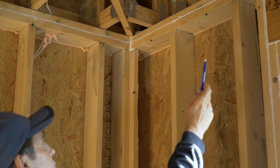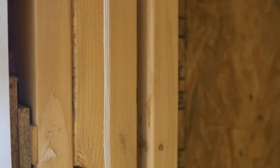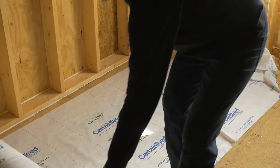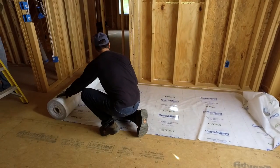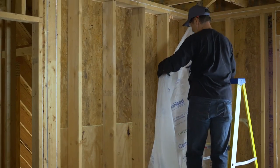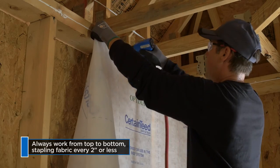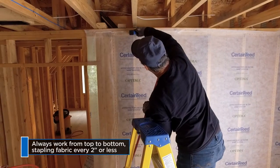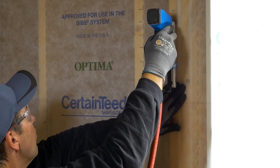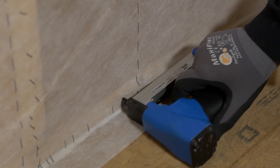Like in the attic, make sure that the walls are also air sealed and you have everything needed for the job. Now you're ready to cover the cavities with fabric. There are two methods: gluing and stapling. Gluing is used for metal studs only. For wood studs, start in the corner and staple across the top plate about every one and a half to two inches or less. Keep the fabric pulled tight as you go. Staple around the perimeter of windows, then staple across the bottom plate.